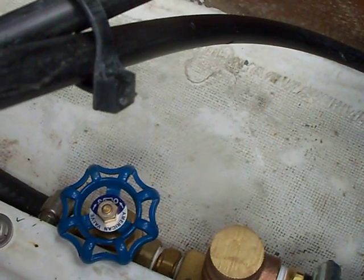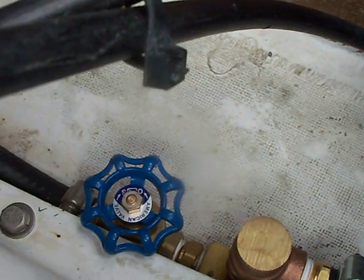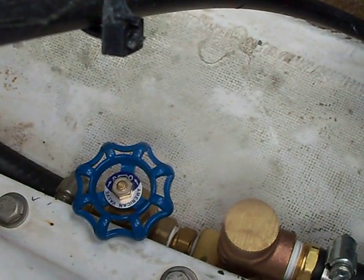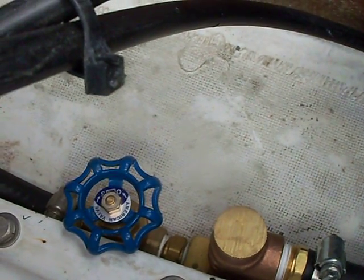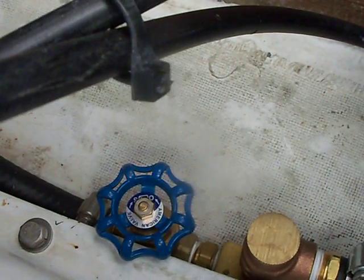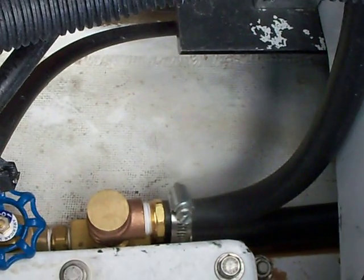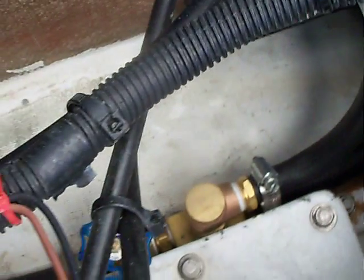There's also a gate valve here. Because I have the restrictor in the thermostat housing, this valve is completely open — water flows freely — and I have the restrictor plate in the thermostat housing, so pressures are working out perfect. This gate valve is basically used as an emergency valve: if you get a broken hose in the middle of the lake you can close it to prevent water from coming in and sinking your boat. Having the relief valve plumbed in isn't hurting anything; if I ever change the impeller and my pressure changes, it's there if I need it.